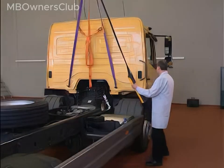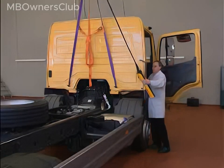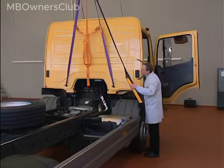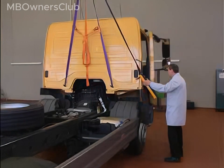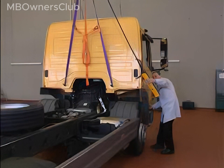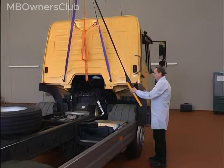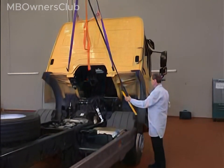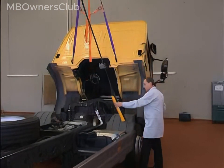The cab must be unlocked. Pull the cab up slowly. When the second detent is reached, the cab must be unlocked again at the lever below the door. Now the cab can be tilted all the way with the crane.